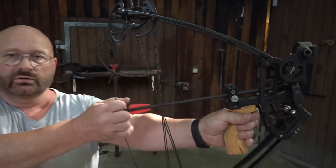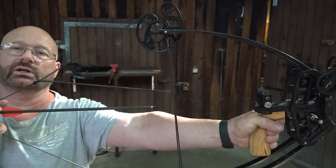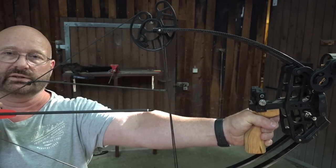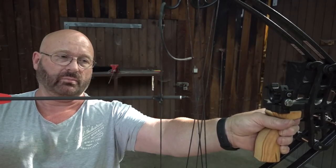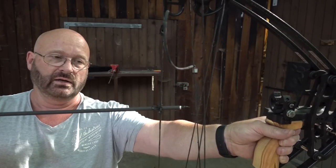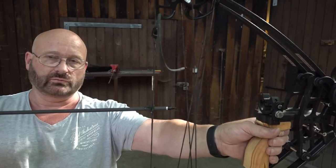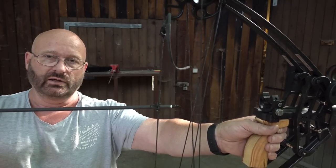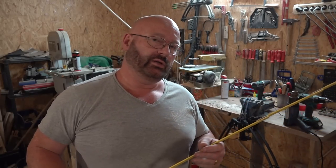In the cocked condition, the arrow is not hindered by the strings - it's shorter than the strings. But also it is possible to stack it up right on the string, and this is important because this is basically the mechanism to stack up the arrows. The lowest arrow needs to rest on the string and only falls into the slot in cocked condition.